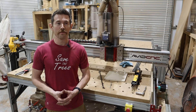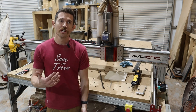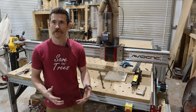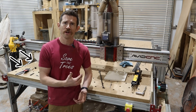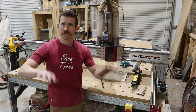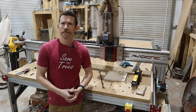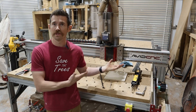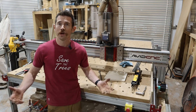As you'll see watching this video, I had one of my bearings completely exploded and I didn't even know it — I couldn't tell by the way it sounded with all the components attached and with the weight of the gantry on it. But once you take it apart, it's extremely obvious. I put this off for a while because the linear bearings are actually what hold the entire gantry in its vertical position. If you took them all off at the same time, it would just fall. So I developed a process where I take them off one at a time and rotate around.